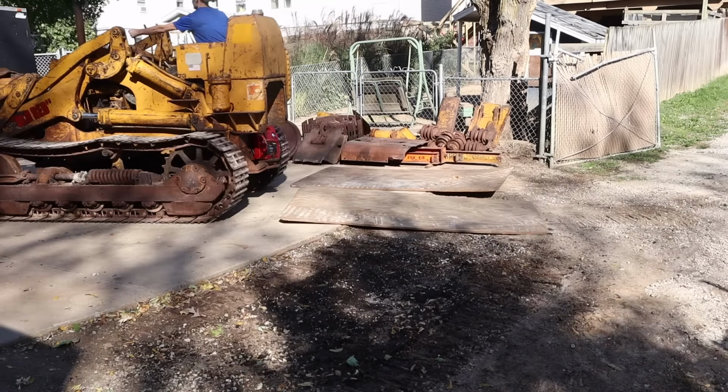Okay, I found a coolant leak, a water leak. You can see right here, right above my finger, there's a water leak right below this head gasket. Ah, the pressure washing revealing all these wonderful adventures we're gonna take on. There's something going on right there. And I think this valve cover might have some issues. I know right here one of the caps for the valve cover nut is broke. In reality though, this is not a real hard motor to get into. It's pretty straightforward. Still have no leaks in the radiator.